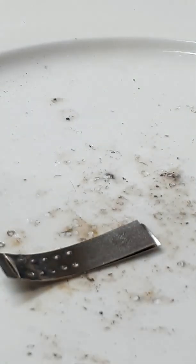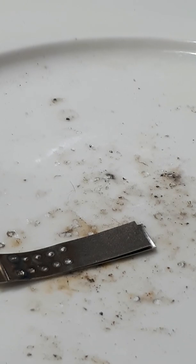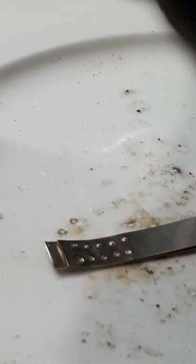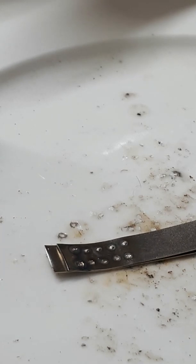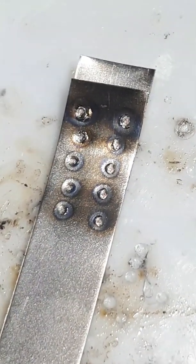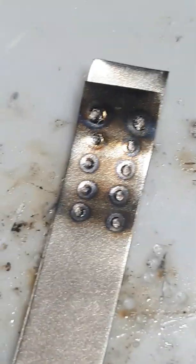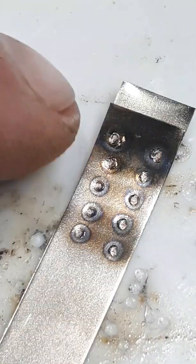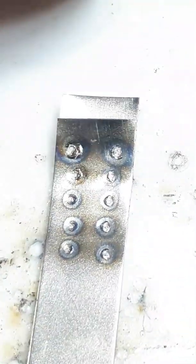As you can see, that was the fastest pulse I have — I believe that's about five milliseconds. The welds are just perfect. I don't have the proper copper tip right now, but you can see a little pink residue left behind. Those welds are perfect. The first one was the medium timing, which is for a thicker strip — I'm going to use that now.